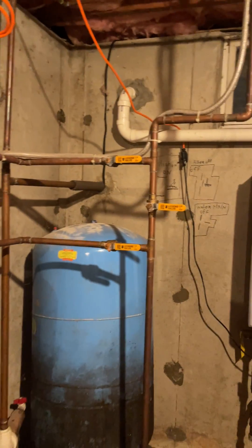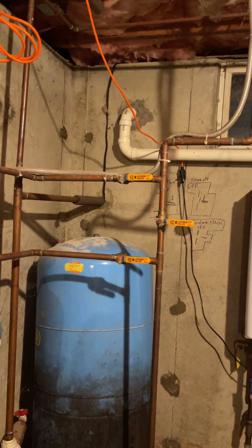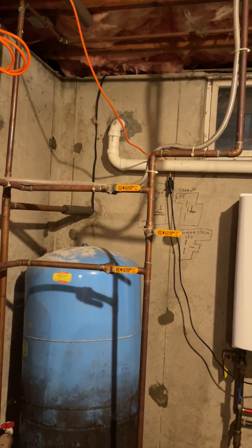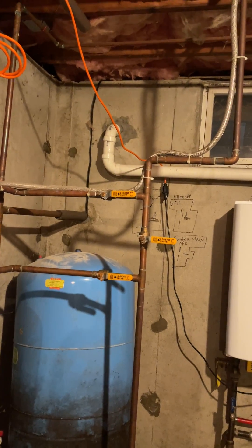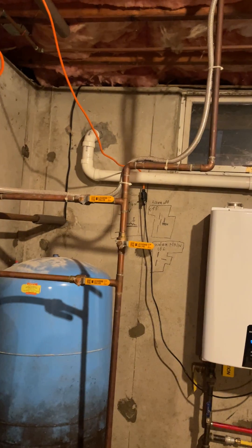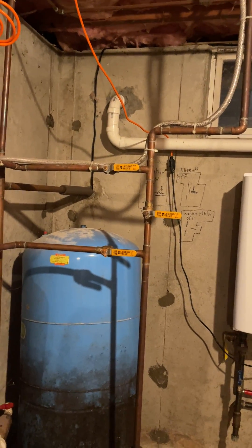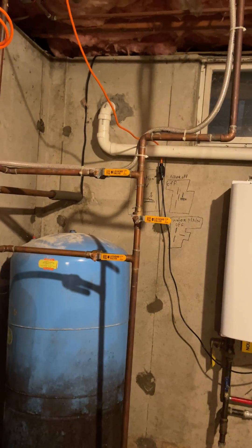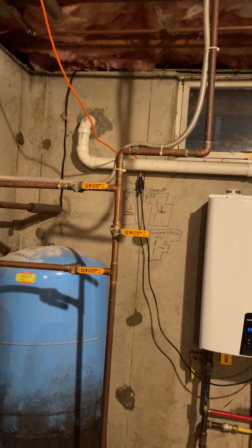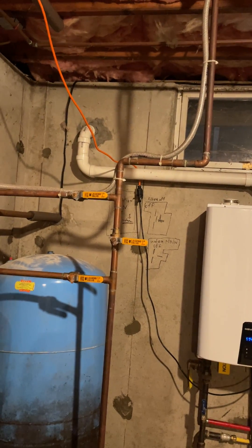If you weren't going to be here for a long time, you've got traps in your sink and traps in your toilet - you would put antifreeze in. That's how they winterize throughout the house. After you drain it, the trap will still have water in it and that could freeze. Your toilet might freeze too. Use antifreeze - like for RVs, non-toxic antifreeze for RVs, trailers, or boats.